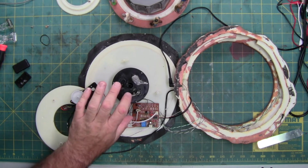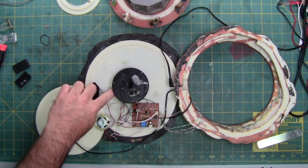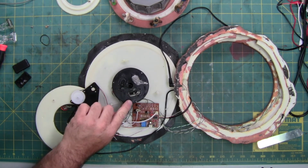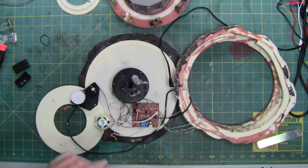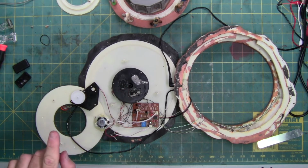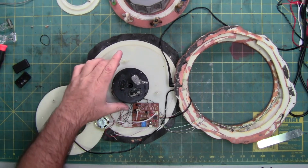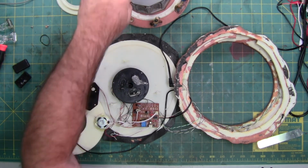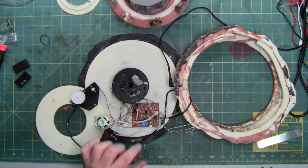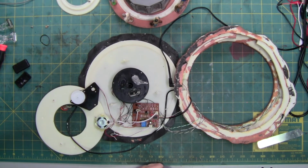And then on this one especially, now if you have a power outage, there's no control, but on this one especially, since it's using either a sensor eye or a count to count these teeth, it may not remember which direction it was going when the power was cut to it. So if it's halfway up and it was going down, then it says, oh, I got to go back up, and it's going to count 30 teeth. 30 teeth would be up here from the halfway point, which is going to push this disc onto this inner lip, causing the gears to break. Hopefully you just break the worm gear. It's replaceable. If you break this ribbed shaft, you're going to have a bad day.